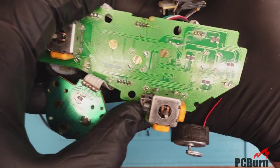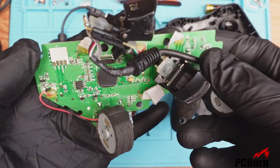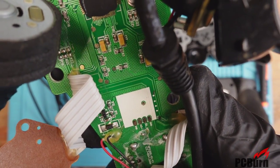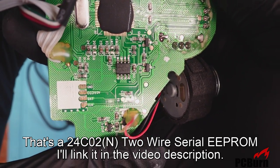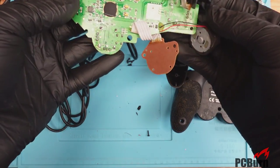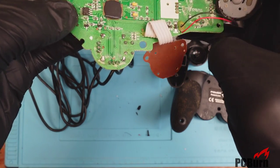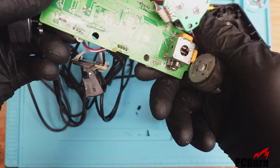I'm not seeing a date on here, but I am finding a few interesting things. It looks like there are extra LED mounts for LEDs around each one of the analog joysticks. There's also a breakout port for logic on the IC — probably test ports for the analog controllers. There's an Atmel chip on here as well, an Atmel 935 — one I'm not familiar with, but I'd assume it's one of their 8-pin micros, probably an 8-bit processor. And here's the logic blob, patched over. I don't know if they use a Padauk or some specialty controller, or just the same as the OEM but de-lidded.